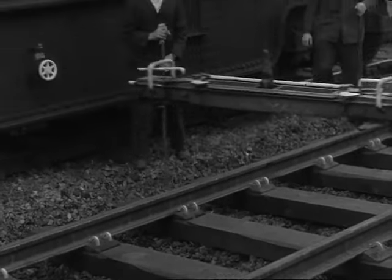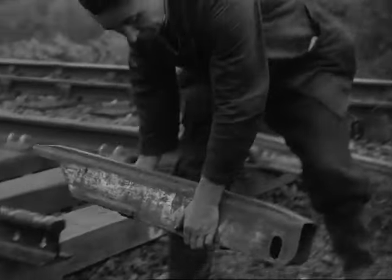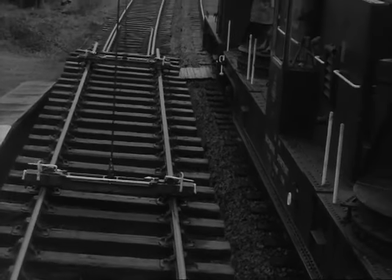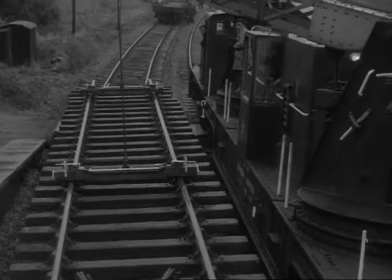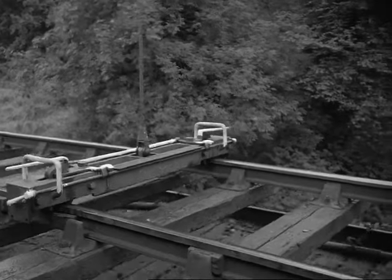While the crane runs forward to lift out the next lot of old track, we put a bridge between number 6 new track and number 7 old. Number 12 old section now. The crane carries it back over 11, 10 and 9 and drops it onto the wagon on 8 and 7 that carried the first 6 new ones.